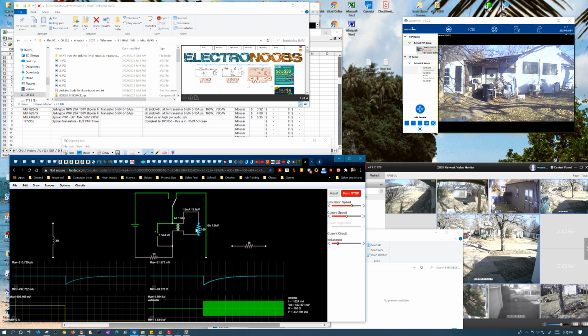Because again, since this is being satiated, why would this need a high voltage on it? This is taken care of, allowing its current to flow, so why would this try to generate a high voltage when something is already taking care of it? That's what I don't understand. I would expect this voltage to actually be quite low, maybe the same voltage as this, but I wouldn't expect it to be that high since this is actually accommodating that field discharge. So I'm really wondering if the reality would reflect this. I'm wondering if this really would be 1 kilovolts given the fact we've got a load on it. Now if we didn't have a load, yeah, I would expect that to be the case.